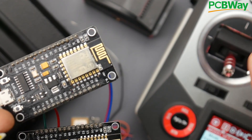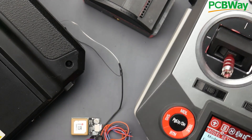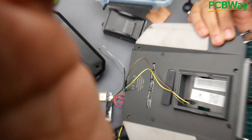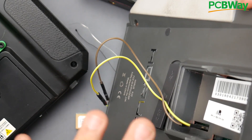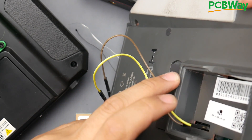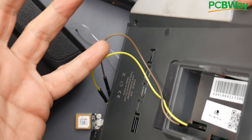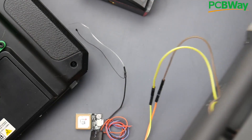What happens here is this is doing everything. All it takes is two wires and obviously power — it'll take ground from your controller and also the PPM output. For example, we have PPM output on FRSky, which is the top pin, and that is PPM out currently. I'm still working on the R9 protocol, but currently we're working on PPM because the R9 protocol signal is getting eaten up quite badly — I can show you that on oscilloscopes. So just two wires here that will go to this ESP8266.